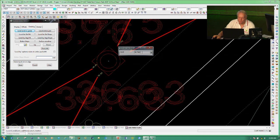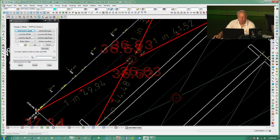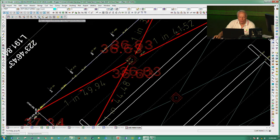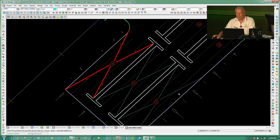Same over here. Basically, once I finish that and toggle off my text, what I've done is look at each point as a minimum and maximum. Then if I include those into my triangulation, I should get a triangulation that gives me contouring around there, knowing that I'm grading down to those points.